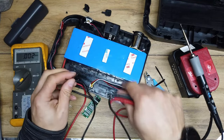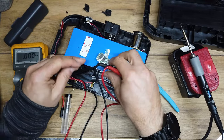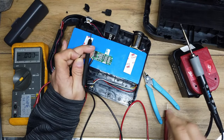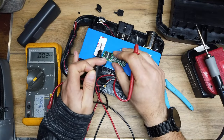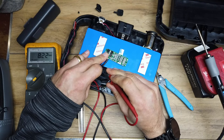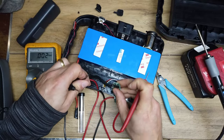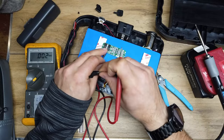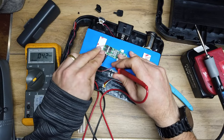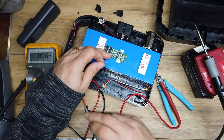One thing we need to do here is make sure that we get each battery connected to the correct terminal of the battery management circuit. Each parallel set of batteries needs to be connected to the correct input on here. Having a quick look at the meter — that's the 8.2 or 8.4 volt terminal. So this is the terminal that we want. Connecting that up correctly, we've got 4.1 or 4.2 volts — so this is the red one.